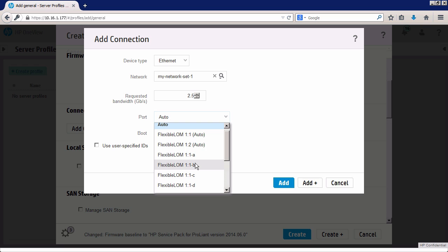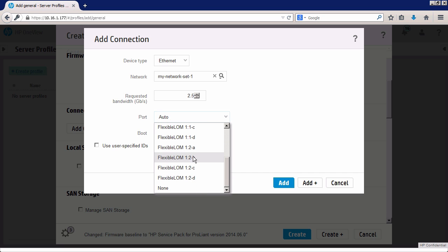The B can be configured as a hardware iSCSI or Fibre Channel HBA, but ACD will be Ethernet only. So you can say, okay, ABCD config as Ethernet, and they are sharing the 10 gig inside port A, or you can say ACD as Ethernet and B as Fibre Channel, or you say I only need the two aggregate NICs, so pretty much I only say A for this port for Ethernet, and B for Fibre Channel. The same thing goes for port 2.